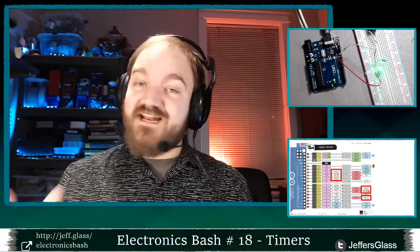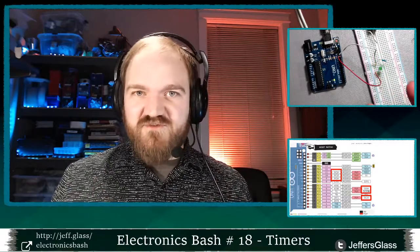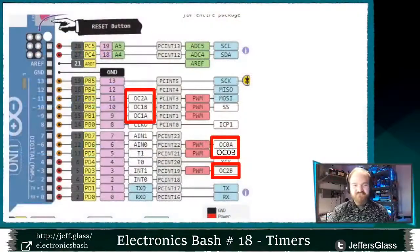So they're able to toggle themselves on and off as these timers increase, and then turn themselves back on when it wraps around to zero and turn off at a certain level. That's a hardware functionality. That's not actually happening in code anywhere. We're making use of the built-in functionality of these timers to do that pulse width modulation, right? Nerd tangent aside, interesting fact.